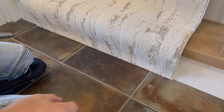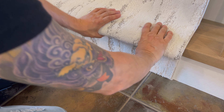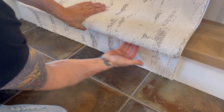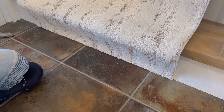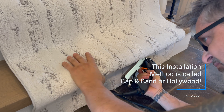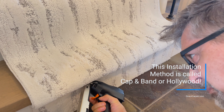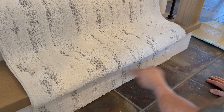We are not waterfalling this today — we are following the contour. What I like to do is pre-form this with my hands because we have to get it under that 90-degree angle. We want to pre-form it a little bit. We already know that we're lined up, so let's get under there. Put a staple every two inches — double them up if you want. I like to double them up at the end. Feel along to see if anything popped out. That feels good.